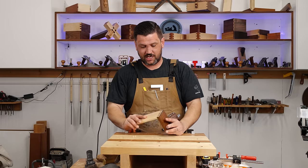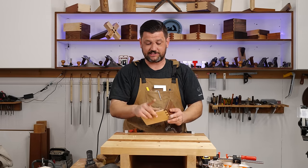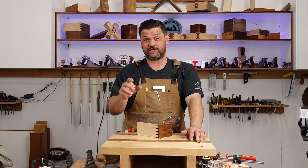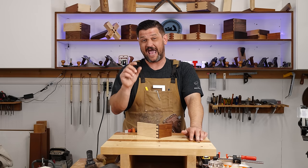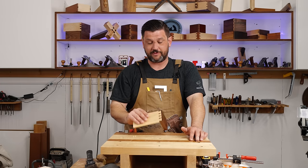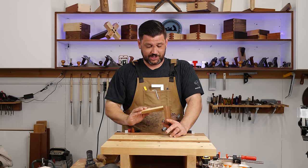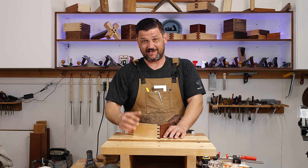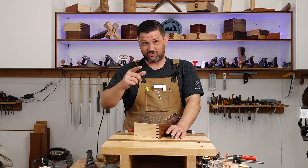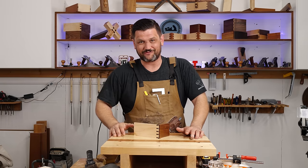That came out great. This is a utilitarian joint. One thing to note — I did misspeak when setting the depth line: I measured the thickness of the board when I should have measured the thickness after the rabbet. Small mistake — it was only a sixteenth of an inch — and it just took an extra minute to take off with a hand plane. But honestly, this came out absolutely gorgeous. Next week we're going to do inlaid half-blind dovetails, which is really exciting. If you're new here, please subscribe — we'd love to have you. Thanks for watching, stay safe in the shop, and have a wonderful day.